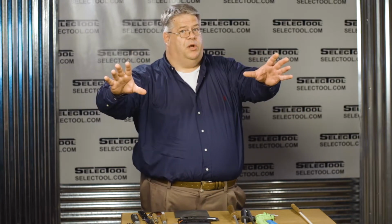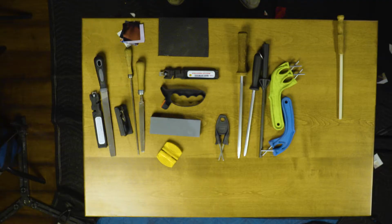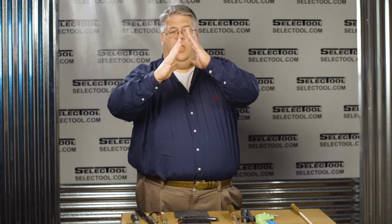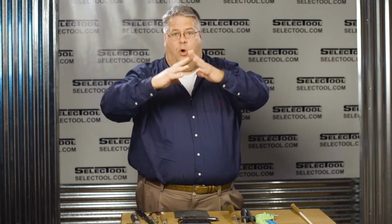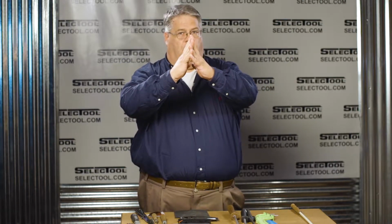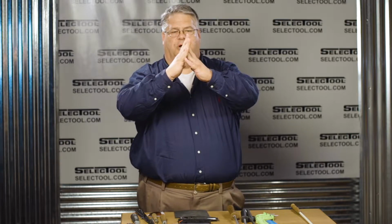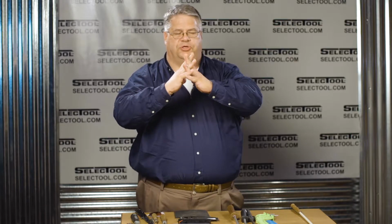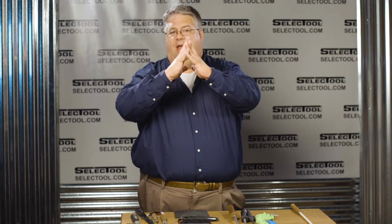So, this is the proper breakdown. This is what you want to do on an ongoing basis, all right? You want to shape the edge. You want to go from dull and rough to smooth and well-shaped, same angle on both sides. Once it's been shaped, you want to straighten. All right, those little tiny teeth, either that little burr, straighten it. Those little tiny microscopic teeth that have been bending and folding and being used, straighten them back up. Shape once, straighten many, many.